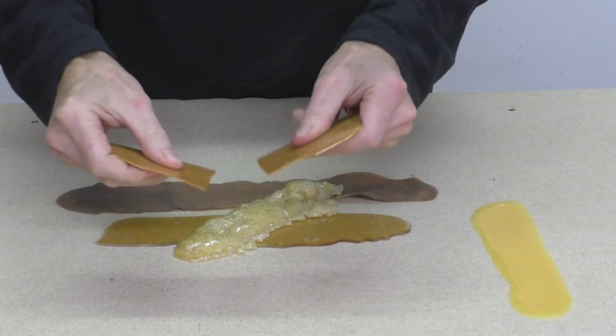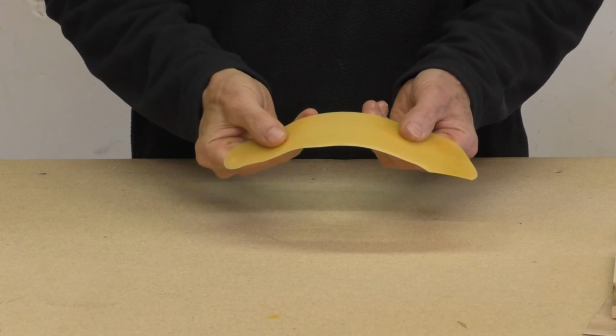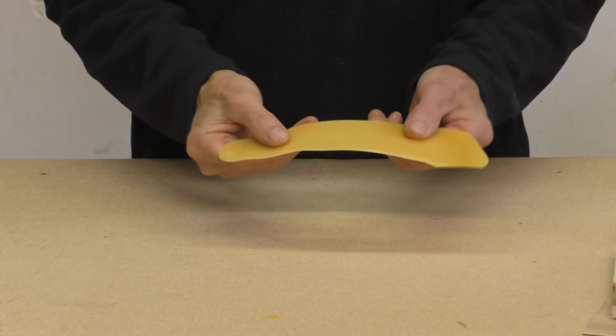When I'm considering a PVA glue for veneering, I look at 4 qualities. First and foremost, hands down, is hardness. As hard as possible. I want to get as close to a urea resin as can be achieved. Let's go back to the sample glue testing I did earlier. You'd be surprised at the range of hardness with PVA glues. Here is a very common PVA glue and what I would call the mid-range of hardness. Somewhat flexible, somewhat stiff.